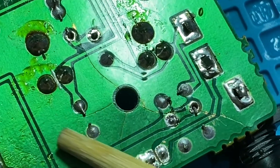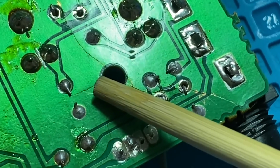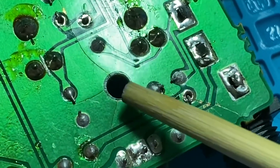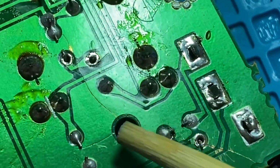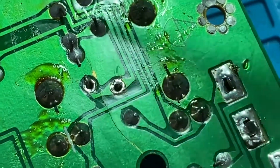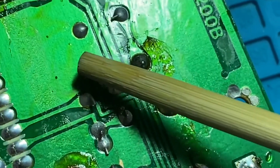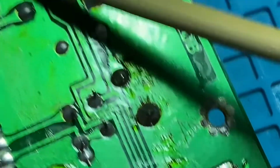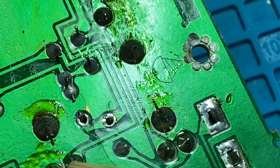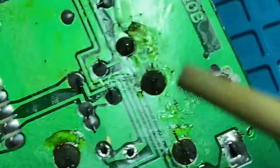These breaks, I think, probably don't affect much because this is such a large area. It looks like it's still got contact where it would still have contact. There's a break here that I'm not sure did not have a jumper, so from this point going along that contact trace, that's going all the way up to that point. So if you go back, from there, around here, around here, around here, up to there, so that did not have a jumper.